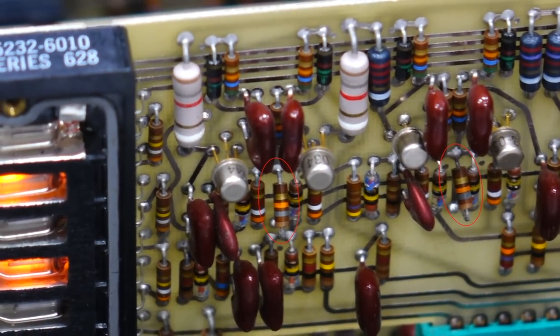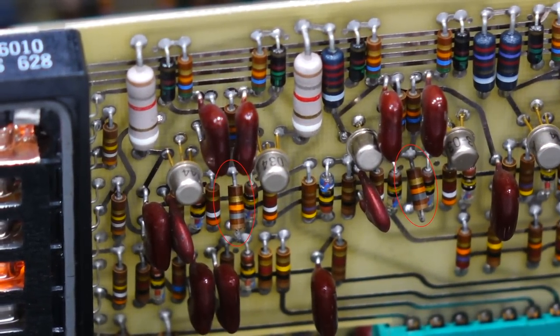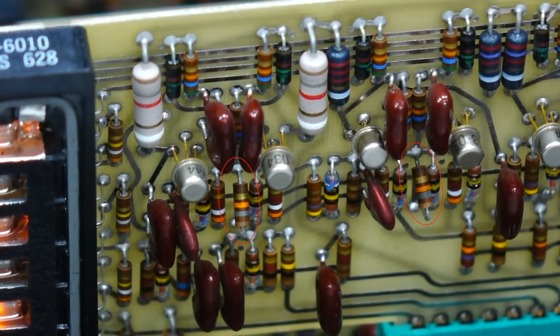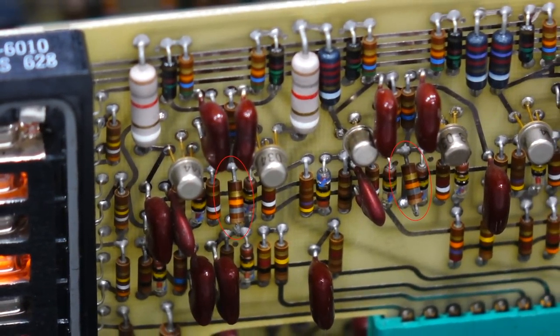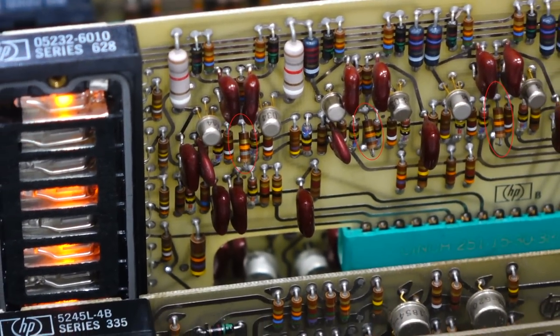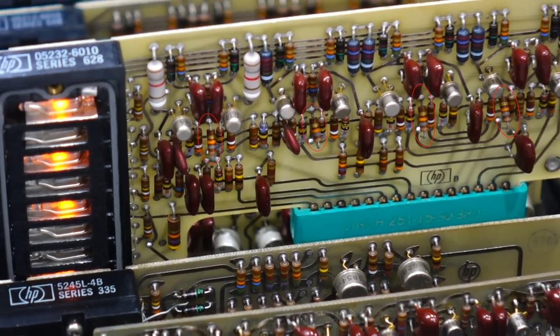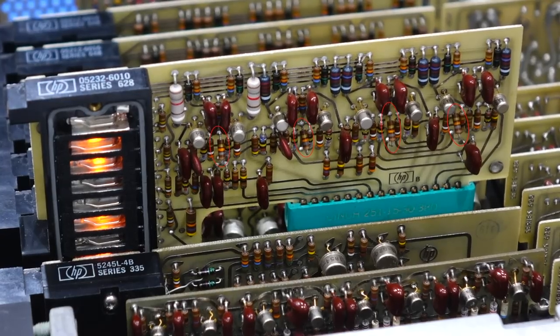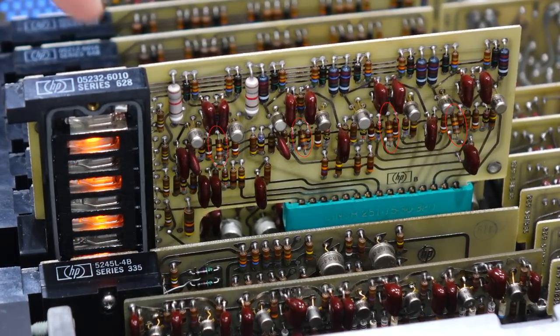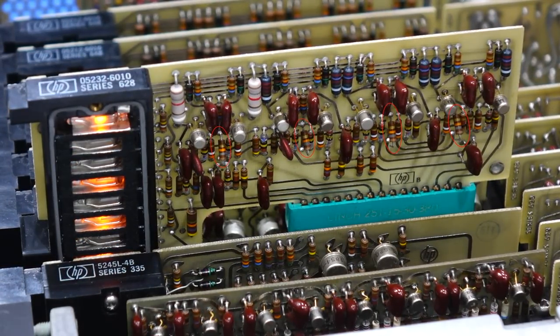Here is another annoying fault for you. It appeared as if some flip-flops were not working while others did, making me suspect some transistors, but the culprit was actually a reset line at an intermediate level. I had to disconnect some circuitry to isolate the root cause of that silly bug and make my flip-flops temporarily work with the reset function disabled.